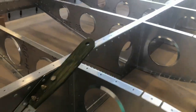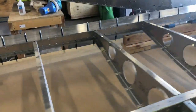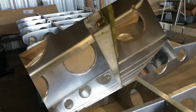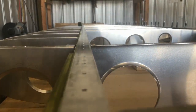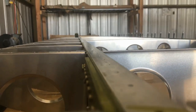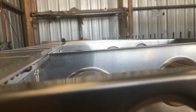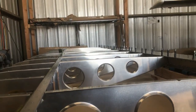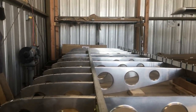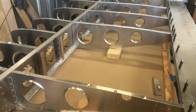Here I'm starting to level the skeleton and eventually I'll be attaching it to the work table. I got the spar vertically and horizontally the way I want it. What I'm going to do next would be to screw a block of wood down in two places along that spar into the work table, and that block of wood — the edge of it — will overlap onto the spar cap and hold it tightly in place.